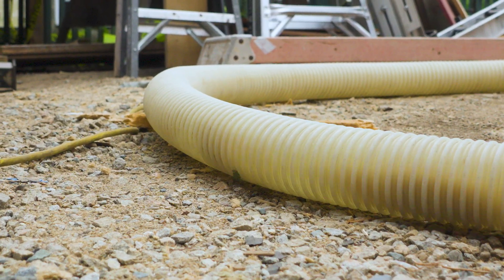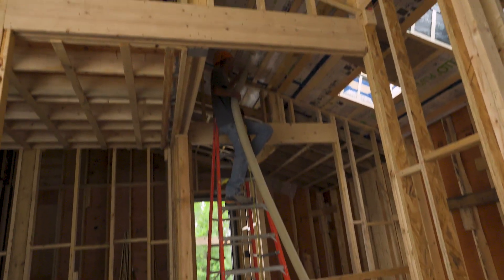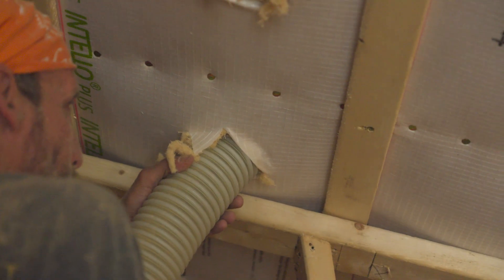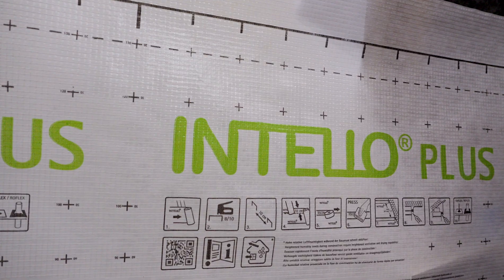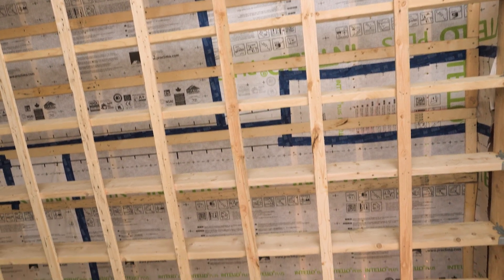We are at the Cambridge ADU here with Timber HP being installed by Custom Insulation. They are dense packing this very well to prevent settling. The reason we chose this product and assembly is for risk management — we really pay attention to our water and vapor risk here at Auburndale Builders. We're initially controlling the moisture drive with Intello Plus, which is a smart vapor retarder. It can actually change size and vary how much moisture it allows to pass through in either direction, so it's a great product from 475. We use it an awful lot and it works very well for us.